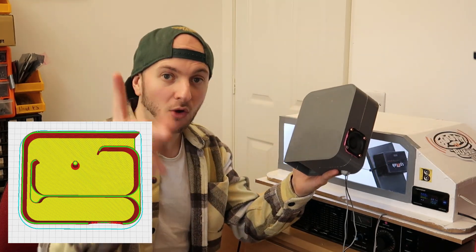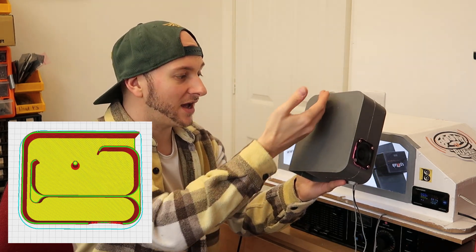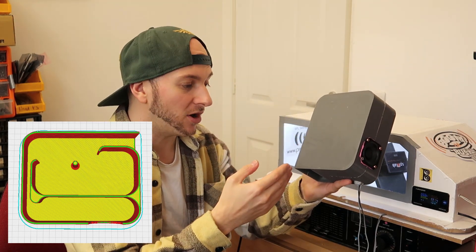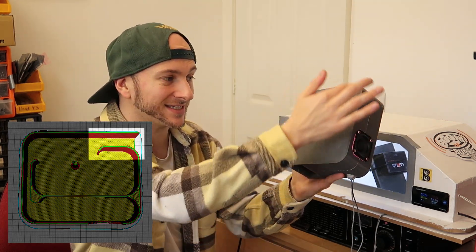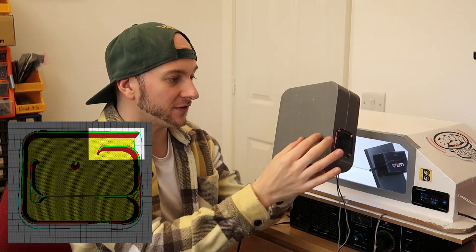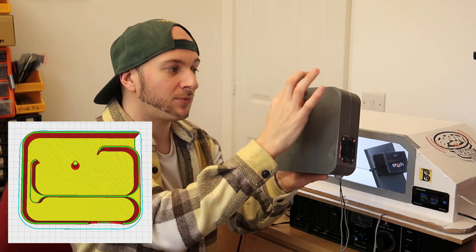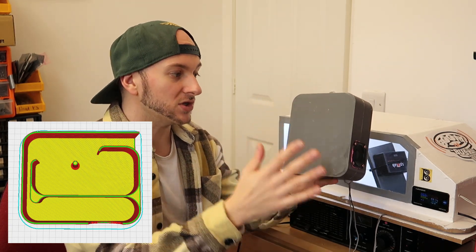It just kind of routes its way out at higher frequencies. But then at the lower frequencies, this port unloads, therefore just giving a clear pathway for the enclosure to see the rest of the box, whereby this second port loads at a lower frequency, because now we've got this whole box that the driver is seeing - the whole volume - rather than just the first chamber.